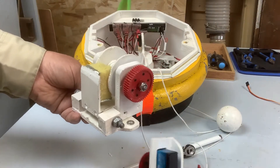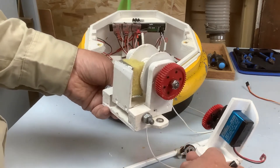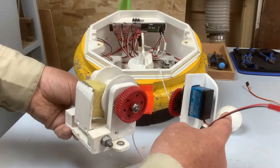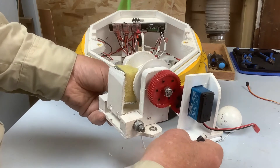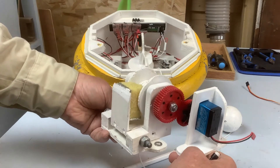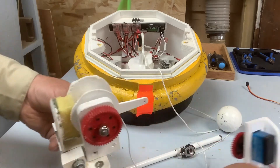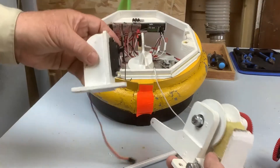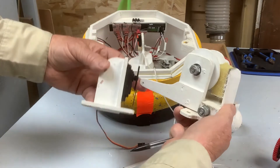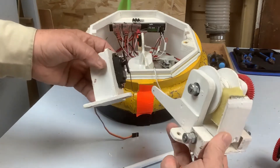The second sub-assembly is a 35 kilogram servo. I'm a bit new to servo stuff so I didn't know how to specify it — I could probably get away with a smaller one. I've converted this to a winch by removing the electronics and wiring directly to the motor, so that comes to the speed controller and meshes with this to wind it up or pay it out. When you drop the anchor, the winch itself pivots up and separates from the drive servo. The only other small sub-assembly is a small servo that connects directly onto this lever on the end of the winch assembly — it just lifts it up to drop the anchor and then drops back down again.